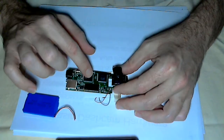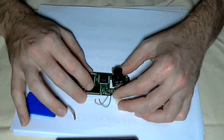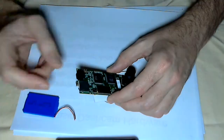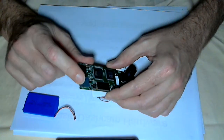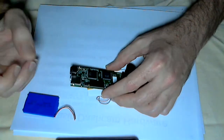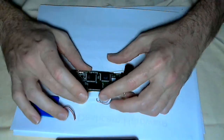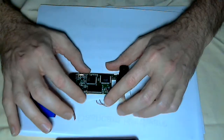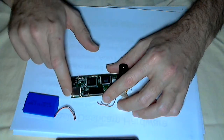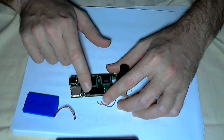The way this works is it's recording, converting, and then it's storing into a memory card, usually in the electronic dash cameras, and then once it reaches a certain size, based on settings or just built into firmware, it then records it as a file, some type of a separate electronic file, usually in segments of 1, 3, 5, 10 minutes. It really depends. For this thing, it's pretty much hardwired to record at like 1.5 minute increments, and then just keeps recording those. So it fills up its memory, and then it dumps that video onto the card, and then it's recording the next. And this allows it to constantly record.